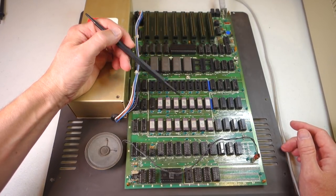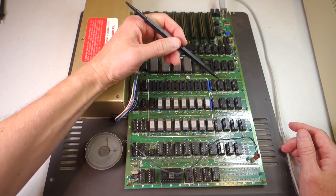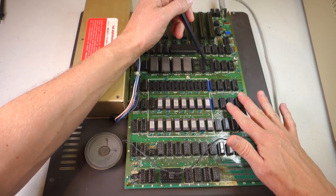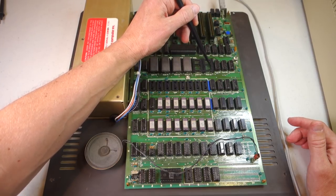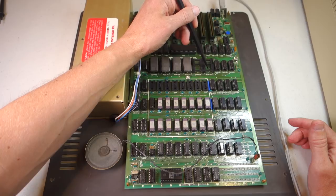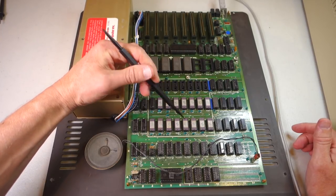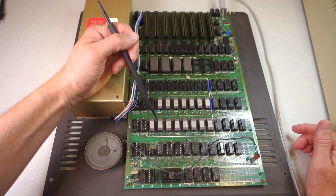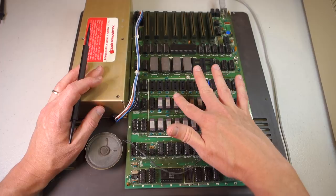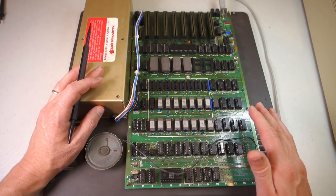If that doesn't do it, examine the board more closely for subtle damage. Look at the traces on the board — on this particular board, the problem was a broken trace underneath the D0 ROM, as if somebody had dropped a screwdriver on it. That was a really subtle but easily fixable problem. Chips can also actually burn out — you might find bad RAM chips or other failed chips. Sometimes you can turn on the computer and feel the chips to see if one is particularly hot compared to the others; a much hotter chip is typically a suspect, though not always.